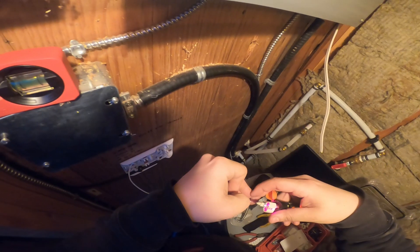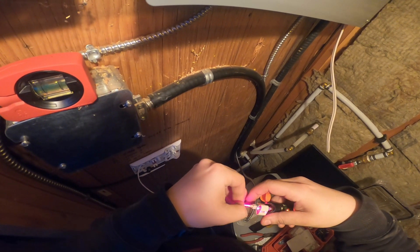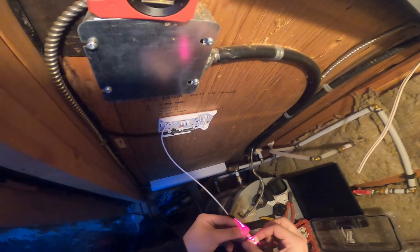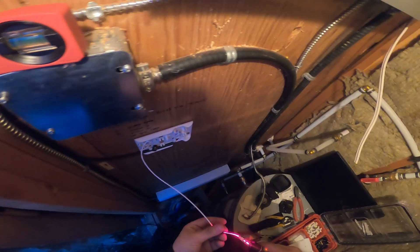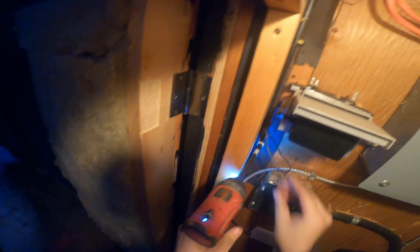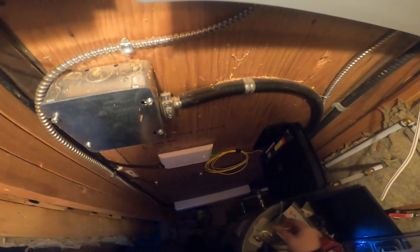These are a little bit behind here — there we go, boom. We are lit up nice and bright, hopefully you guys can see that. This guy's pretty much ready to go. Now I just have to finish the connection at the other end to feed the service through the fiber, and then we come back, program this guy, and we're all done.